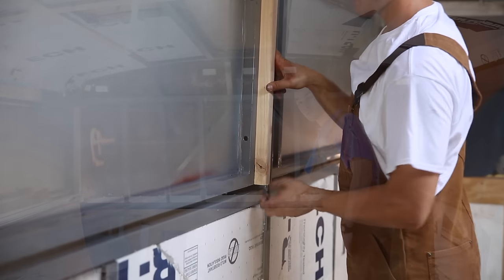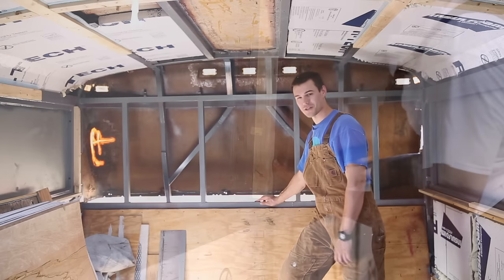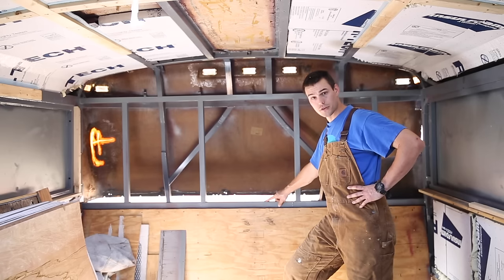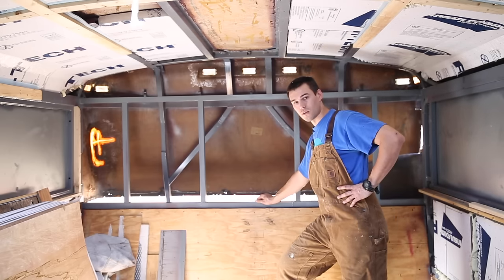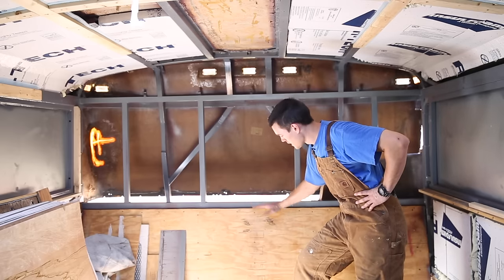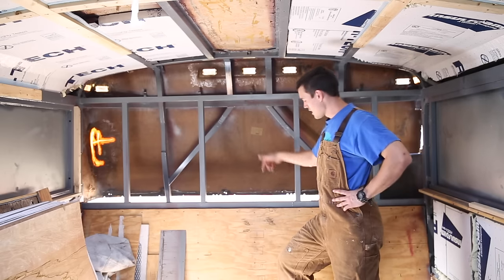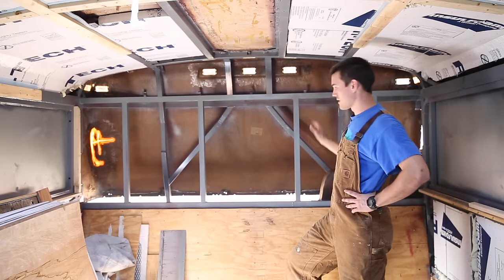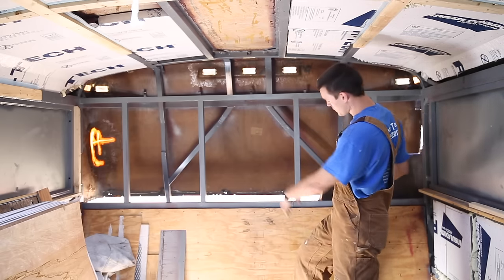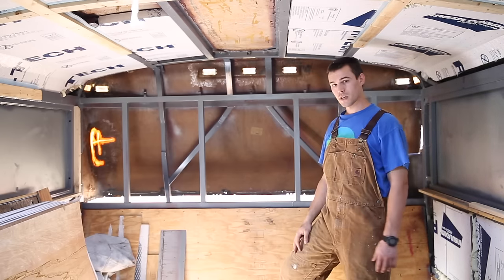Like with the windows, I drilled a three-quarter inch hole into the tops of the one-and-three-quarter square tube, then a small pilot hole inside that. The top layer has the large hole, the bottom layer has the small hole, and I drove small screws in through them. This wall is connected on either side by being welded into the frame, and we also have three anchor points in the center — it's very sturdy.